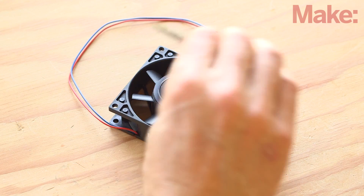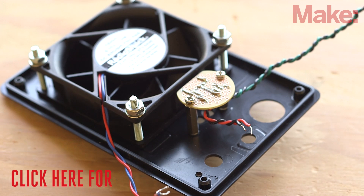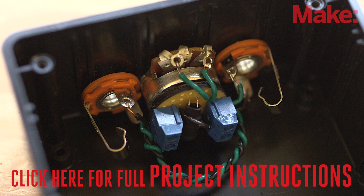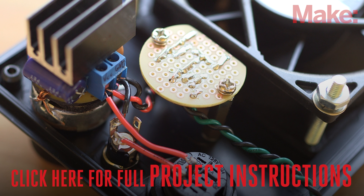Now you can easily mount and swap repurposed CDs to the motor to serve as tremolo discs. Follow the directions on the project page to mount all the necessary components to the enclosure — use screws to mount the fan, standoffs for the tremolo circuit, and the supplied hardware to mount the potentiometer, switch, and jacks. Then add wires to the power jack and the switch. Install the dial-a-speed motor controller and connect it to the fan, the switch, the power jack, and sensor board as shown. Check out the project page for more detailed instructions as well as tips on how to make your tremolo battery powered.